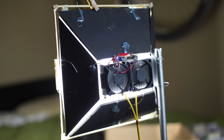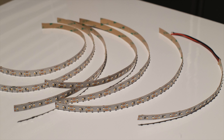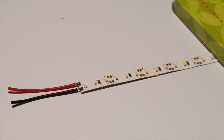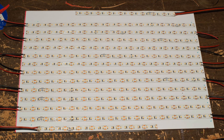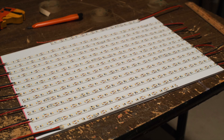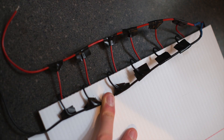Now I didn't intend for this light to be permanent, so I built a nice panel using these High CRI Flexfire LED strips. These strips are very bright and come in a variety of color temperatures. For this build, I used a coroplast backing as a base. On the panel, I alternated between 4200K and 6000K strips so that the color temperature can be precisely adjusted by dimming every other row. I first soldered short wire segments to each strip, attached one color then the other with the wiring on the opposite side. The LED strips have an adhesive backing which makes attaching them very easy. Next I soldered each side onto the main power wire for both positive and negative, then sandwiched them under some coroplast strips to tidy things up.